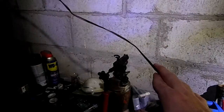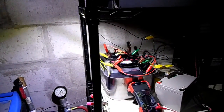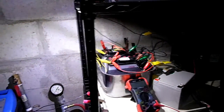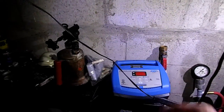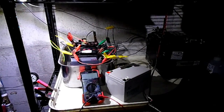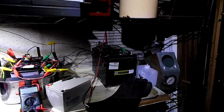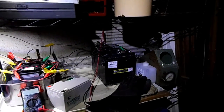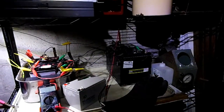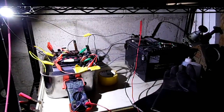The solar panel itself will only provide up to 3 watts, and the desulfator takes 2 or 3 watts, while the lamp itself is 4 watts. So for the time being, until I get a windmill or my bigger solar panel array built — I do have solar panels, I just have to solder them together — I'll come out every few days and charge it with my charger using an extension cord. Once I have a power source over 40 watts, I'd run a cable from here to my bedroom to run my computer. This shed would act like a power substation. I could potentially get 12 more truck batteries for free, which would be one hell of a battery backup system. The next thing I need to do is build a good source of energy, whether it be a solar panel or a vertical axis windmill made out of 55 gallon oil drums.